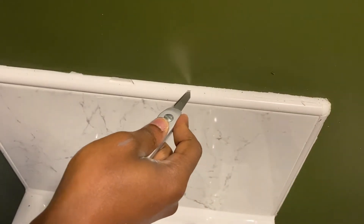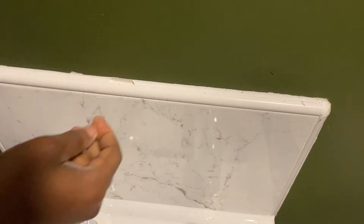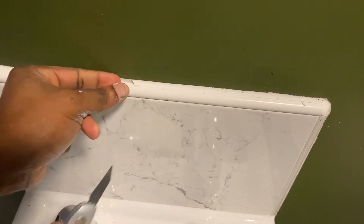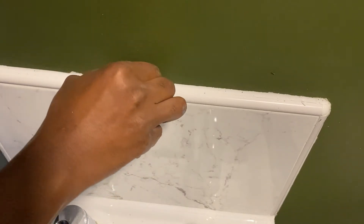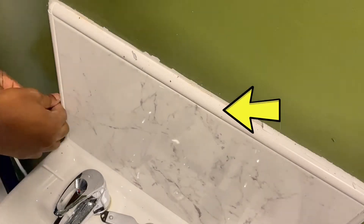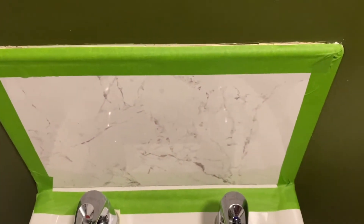So it's more like you're removing the old sealant and the new sealant is going to stay on the new olive green paint. Here, I am using a Stanley knife and taking off the sealant that's right between the plastic in front of the tile and the wall, making sure that every bit of old sealant is removed. Then run the green frog masking tape over the white plastic that's between the tile and the green wall so that I can paint around the areas where the old sealant was. Then once the paint dries, run another masking tape to define the gap where the new sealant will sit.